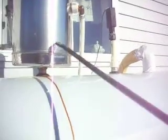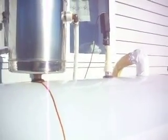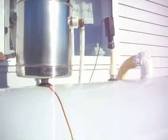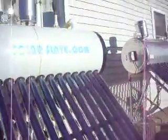This right here is a sensor. It measures the water level. The controller has an option for a magnetic valve to replace the expansion tank to feed water into the tank if it gets low. I prefer this other method. There's a 3-wire connection there. The thermostatic wire connects to the controller, plugs in. The controller also feeds a wire that goes to the electric heater. It's that simple. We run this model in the summertime.